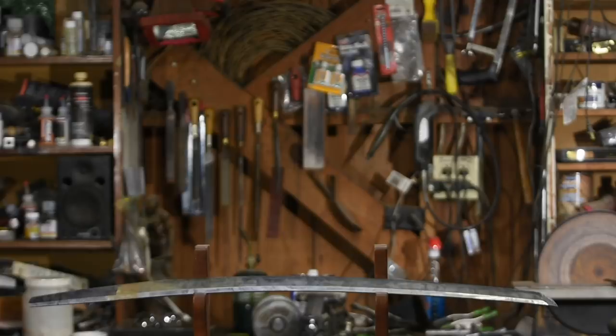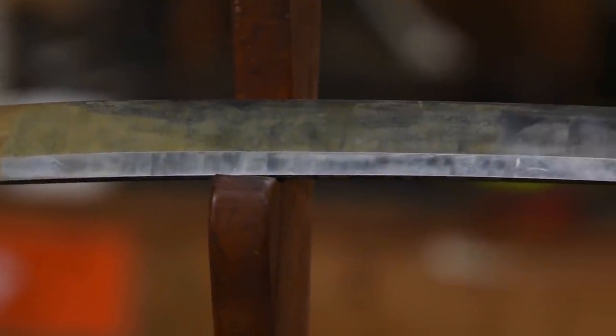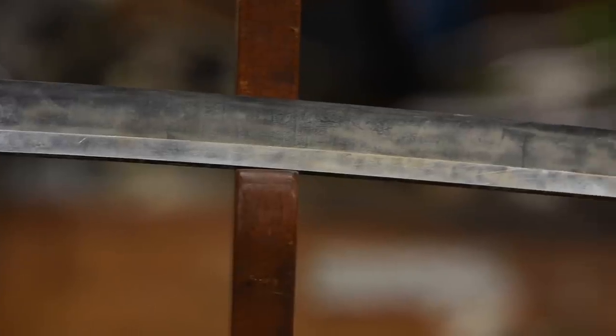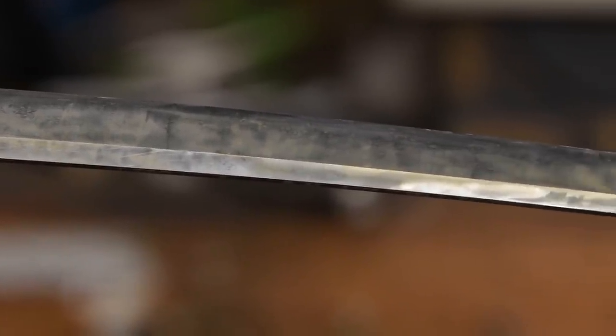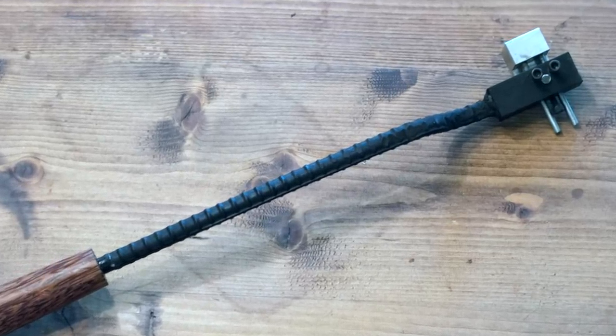The reason for cutting in the groove at this point is simple. If you screw up in the tiniest way in this process — and that's very easy to do, by the way — you can cut a pretty nasty gouge in the blade. So you want to give yourself the best opportunity to fix any goof-ups without having to redo enormous amounts of time-consuming polishing. So before we get started, let me quickly show you the two main tools we'll use.